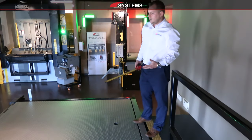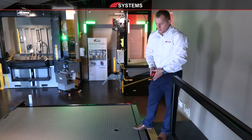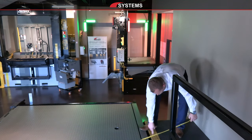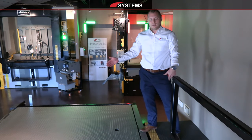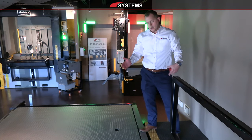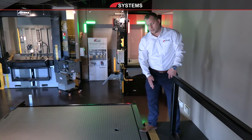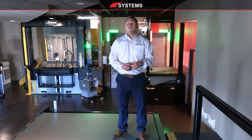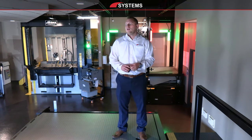To account for variances in dock length, there may be filler pieces at the back of the leveler, so we want to make sure we take the full length of the pit into account. If the dock pit is longer than a standard leveler length, a few inches of filler are added so we can accommodate the unusual pit length, still weld to the rear curb angle, and reach all the way to the dock face. For push-button levelers, also notate the incoming phase and voltage of the electricity so we can match that on the dock leveler's motor and control panel.